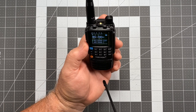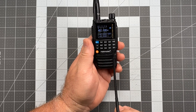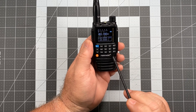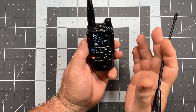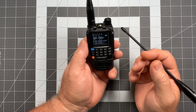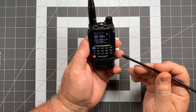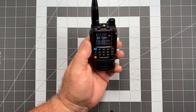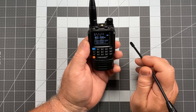You do not hold the radio perpendicular to your face and speak directly into the hole. It says MIC right above it — they were very nice to give us a label there. That is the microphone port. If you talk directly into the microphone, you're pushing a lot of air in there, and this all works off of airflow essentially. That's how it perceives sound and transfers that into an oscillating wave to get voice on the other end. If you overload that by yelling right into the microphone, too close, driving air right into it, it will sound over-modulated.